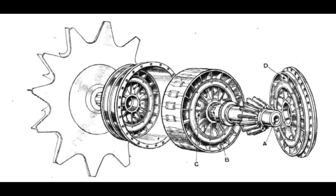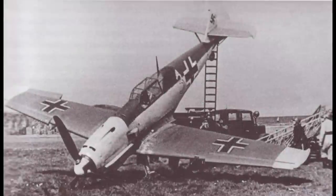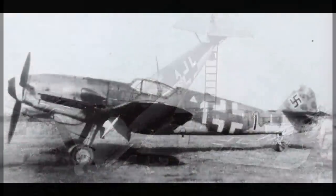None of this should be taken to mean that the 109 supercharging system as a whole was superior to later American airplanes — I don't think it is. For example, typical US Navy fighters had dual superchargers with two speeds on one of them, plus intercooling, and these systems were very effective. However, the 109 supercharger drive system, when viewed by itself, was generally superior. It is a big part of the reason the 109E was equal or better to any other fighter in 1939, and even by 1945, the performance of the late 109s, like the K-4, were about equal to the latest P-51s.